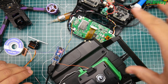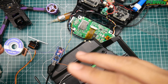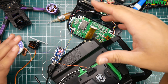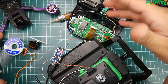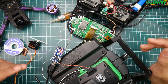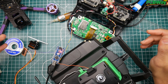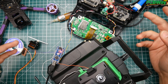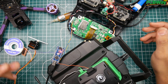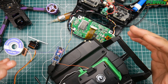Let me know what you think in the comments — if you're curious or interested in this, because it really brings a lot of life back to the Turnigy Evolution. The proof of concept actually works really well. There is some latency — it's PPM latency — but it's not terrible. If you're flying something chill and just want longer range, this will be awesome. It's similar to running the QX7 with TBS Crossfire on PPM, maybe just five milliseconds more.